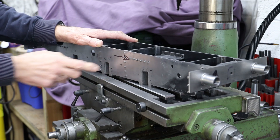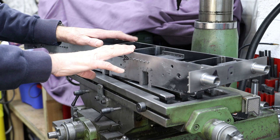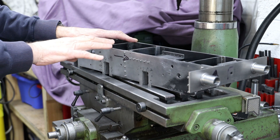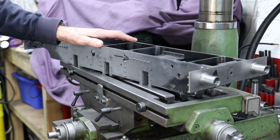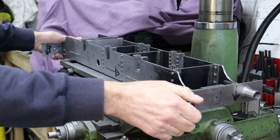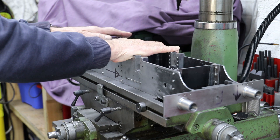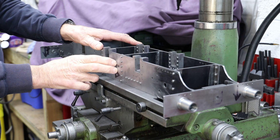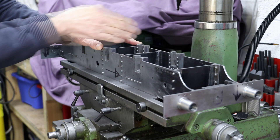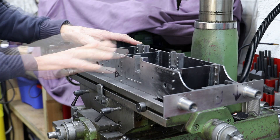I need to make a decision as to how I want to open those horn blocks out. A common approach is to strip the frames down again, put them together face to face, square them up or align them, and then run through the horn block openings with a mill with that pair together. What I'm minded to do is actually machine them in situ — come to an arrangement where the frames are aligned, properly set up, and held squarely, then ensuring enough support on both sides and running an end mill side to side, thus ensuring that the horn internal dimensions are square and aligned.